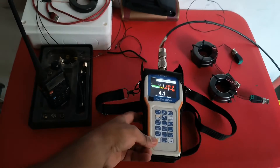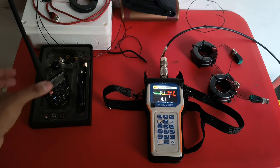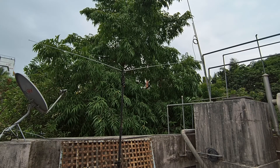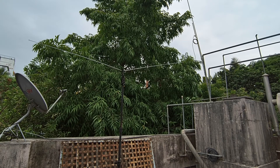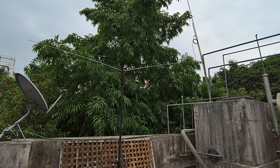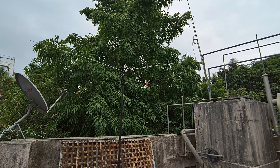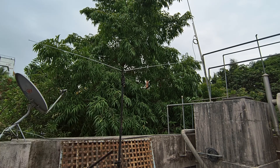The SWR2Air has started. We'll keep the RigExpert here, take our handy, and go outside. This is the antenna — it is right now tuned to somewhere around 74 MHz and we want to tune it to 100 MHz. So I have to shorten the dipole length, and I'm going to do that with feedback from the audio bursts.